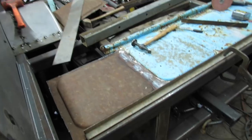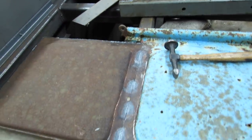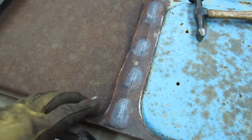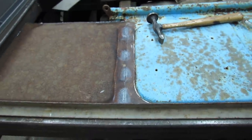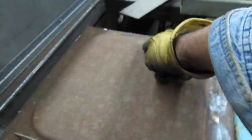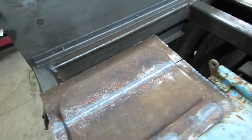See on the time-lapse video, I keep saying that a lot, don't I? I was gas welding that, hammer welded it. I have the frame rail under it, directly under the weld, which makes it convenient. It's a little bit of a heat sink, but you can weld it and immediately hammer it. And you can see there, that weld is going to take very little grinding, and it's straightening out these warbled up pieces. All right, what I'm gonna do now is cut the 4 inches out of this and butt it together. All right, I done gas welded that all the way across.